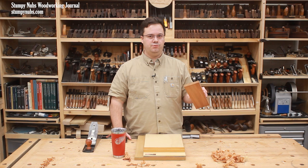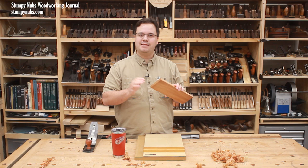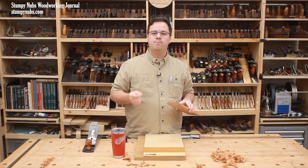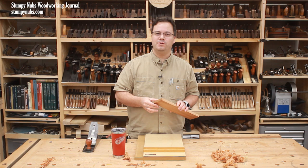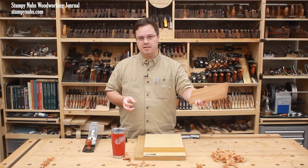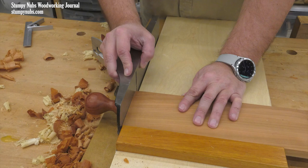Let's start with making precise cross cuts. I try to keep my table saw well tuned, but as I make a cross cut, even the smallest shift of the board on the miter fence, or a little bit of deflection away from the blade, can produce an end that is slightly out of square. Maybe that is good enough for some projects, but for your best work with your most expensive materials, these errors can add up. So good enough isn't always good enough, especially because it is so simple to take that work piece over to your shooting board and clean it up with a few quick passes across the end grain.